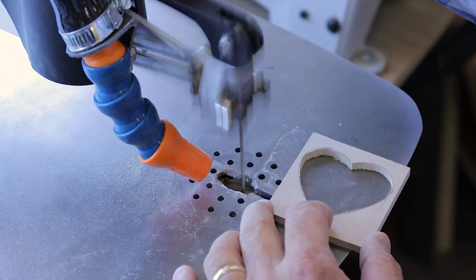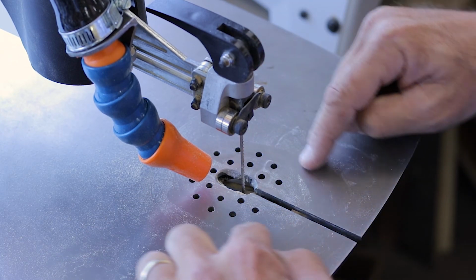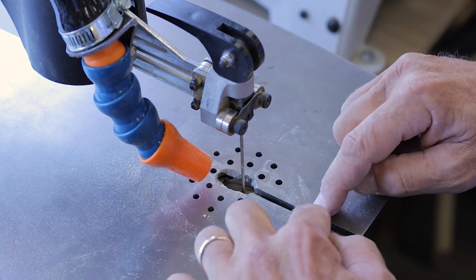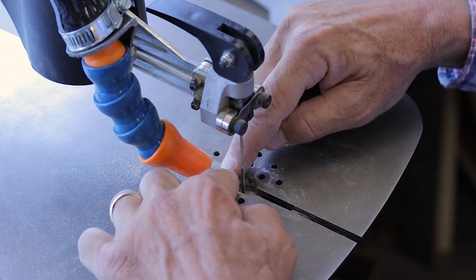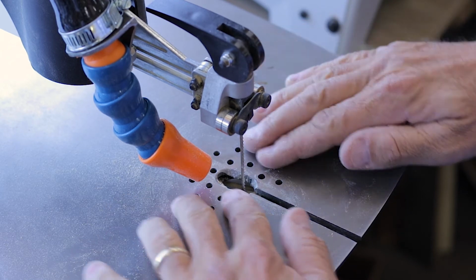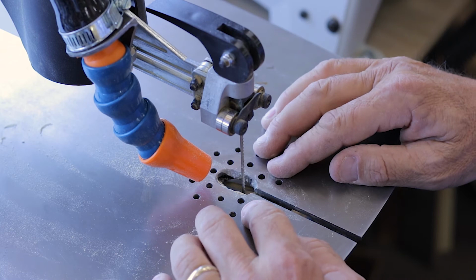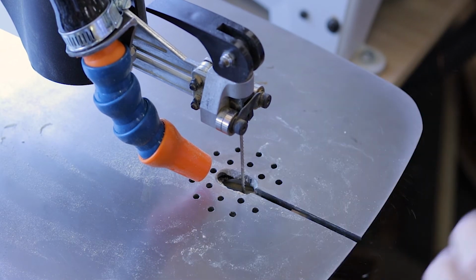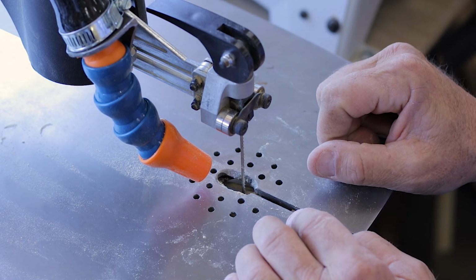When we talk about the safety zone around a blade, this one has kind of an egg shape to it. Far away from here, closer, and real close back here is fine. You can get closer on the sides because if you're pushing and something goes wrong, you're just going to go through. But if you're on the front and something happens, you can't pull back quick enough. You're going to end up cutting your finger.